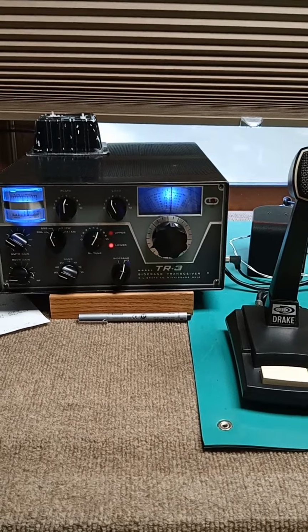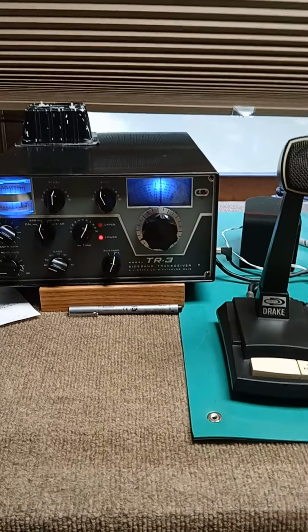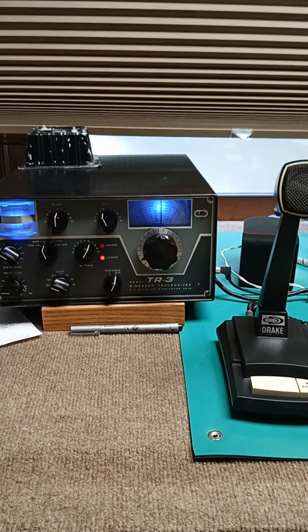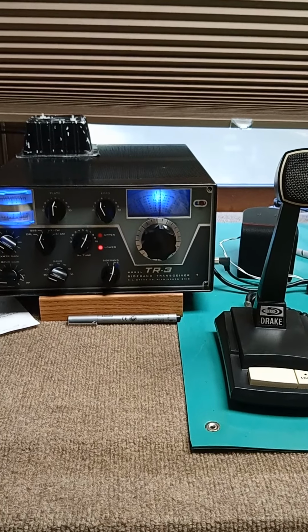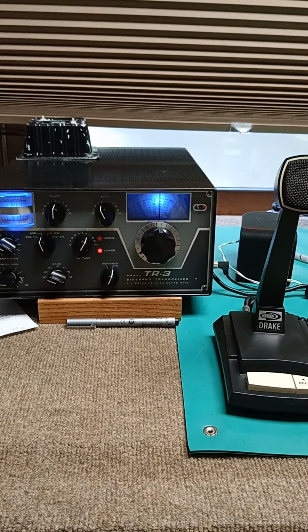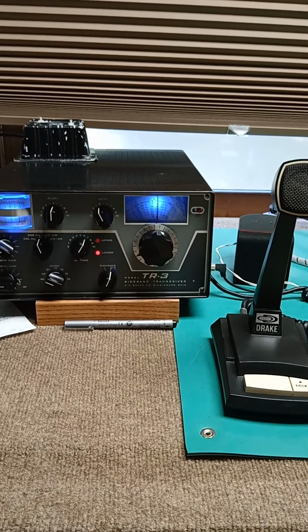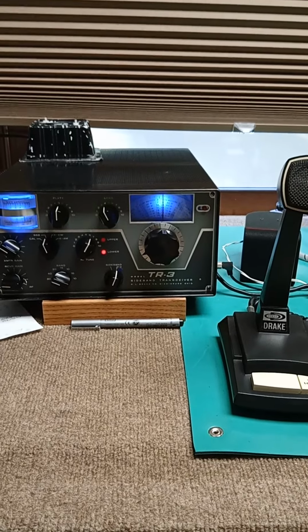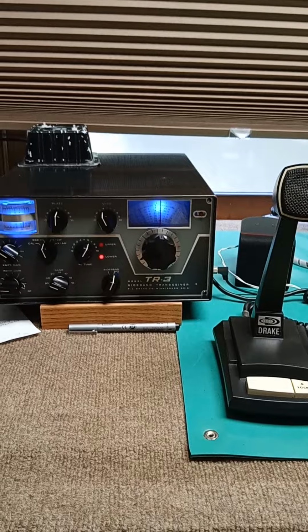It's perfect. It was balanced within a millivolt. There was more 120 cycle ripple on the balance modulator amp and the carrier detector tube, so I had to make a filter for that. But I got the power supply noise down to 50 millivolts for each one, and got the spurious carrier at the final grids down to 50 millivolts, which is nothing.